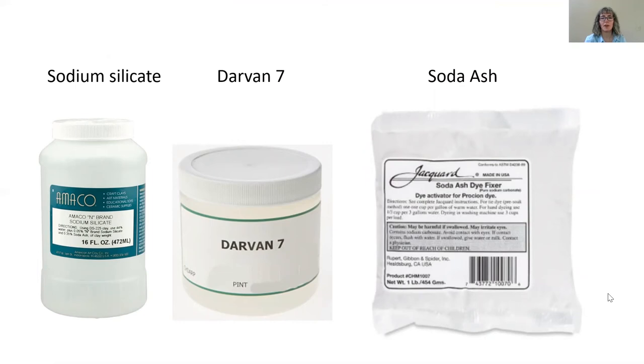It's also important to know that all deflocculants are water soluble, meaning they will all evaporate with your water. So as you use deflocculated slip while slip casting, know that some of the deflocculant will evaporate with the water from your mixture, which means you will need to periodically recalibrate your slip, figuring out if it needs to be thinned with water or thinned with deflocculant — especially if you're going to reclaim your castoffs from slip casting. This video will help you figure this out.